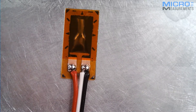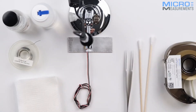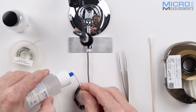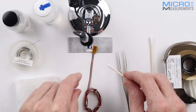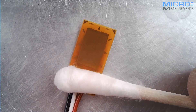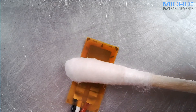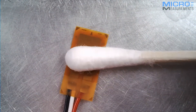This is a very volatile product so I need to blot dry. I'll take a clean gauze and carefully blot the gauge dry, then turn it over and blot the back as well so there's no rosin solvent remaining. Next I need to neutralize it so it's completely clean. I'll put one or two drops of neutralizer 5A onto a clean cotton bud, expose the back of the gauge, and carefully wipe it, gently rotating the cotton bud each time to present a clean surface. Then a clean dry cotton bud to make sure it's completely dry.